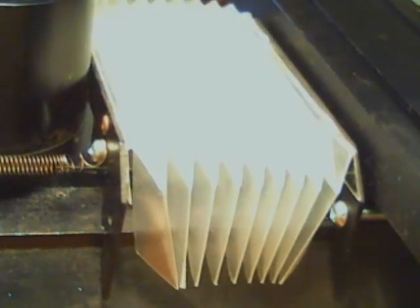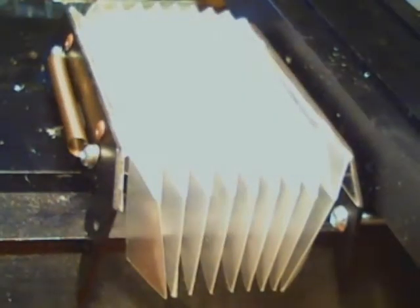Now, you notice all these alternatives I've mentioned involve a lot of threaded fasteners. But I want to just be able to flick it off, yank this baby out, and boom, horizontal mill. Now, once I'm absolutely certain that I love how horizontal this is to the table, I'll redo this alignment bar. I might do it with the angle iron and a couple adjusting screws. And grunk it down really, really good.